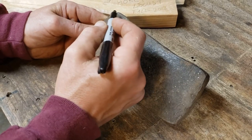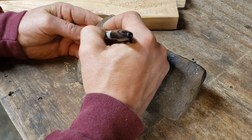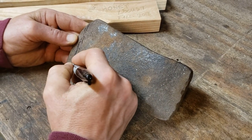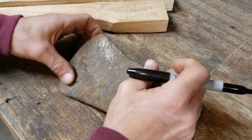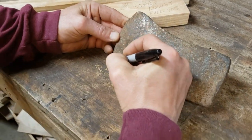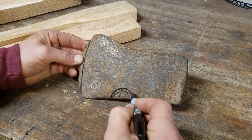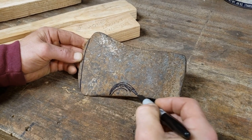That's because with this, there's some wear up here at the toe, and I'd either have to grind a bunch of material back like this to put a better profile to the bit. That's a little exaggerated, something like that. Or I can flip the head upside down, and there's a bit more material up there. I'll have a little bit of an upswept toe, and I then really am only taking off a relief for fingers, and I'm just approximating what I will do.